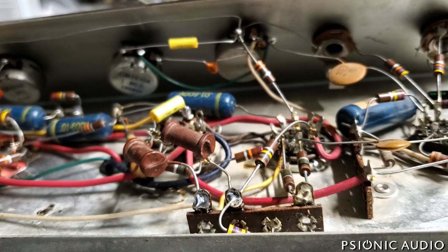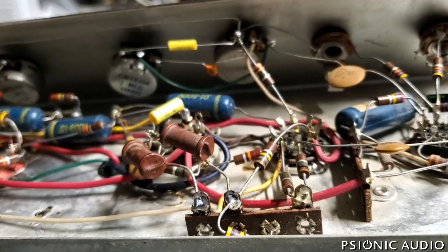Being curious, I added a 20nF cap there. What I found is that the varistors are a very intrusive, lossy circuit — you lose a lot of gain through the varistors, which are part of the tremolo. When you have that cap there, you're essentially bypassing and merging the two sides together. You get a lot more output level from the amp, but you have a very weak, diminished-sounding tremolo. Without that cap, the amp sounds quite nice. It has less output, but still a good amount, and the tremolo has the right depth — you can hear the pitch vibrato that it does. I need to stop saying tremolo on this amp because it's very much a vibrato.